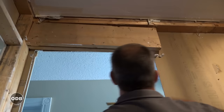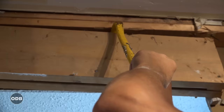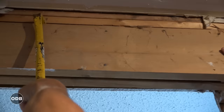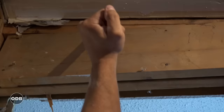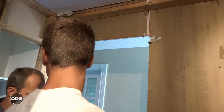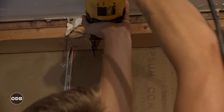This header has nails on both sides, so if I just start beating on it we'll wreck the other side of the wall. I use a flat bar at the top — when I pull it out I'm putting pressure straight up against the plate, not against the drywall surface on the other side. That should just lift it right out.